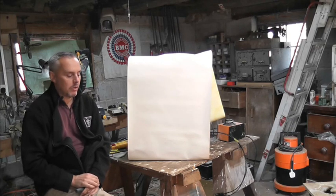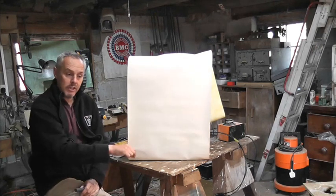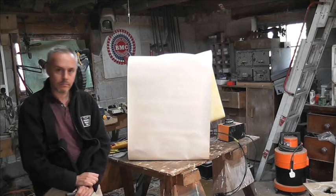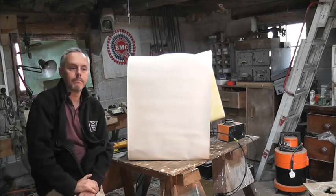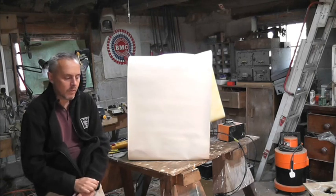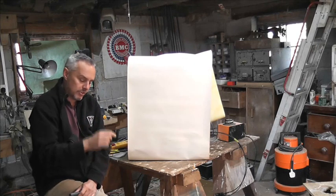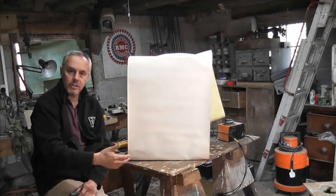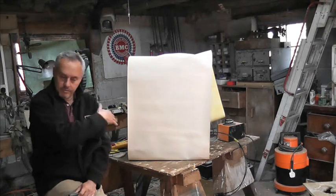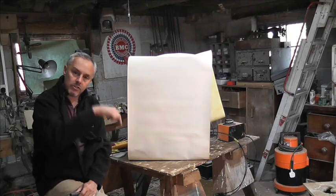I got to the other end of the sensor where the metal bulb sensing tip was - it was in a little sleeve, reasonably easy to push out. It's basically two thin wires with a little electrical connector on one end, and on the other end a small metal capsule cylinder designed to be held close to whatever temperature it's sensing. In this case there's a refrigerant pipe on the evaporator, and soldered to that pipe is a tiny piece of copper pipe - it just slots in and a little holding clip pushes it hard against the evaporator.